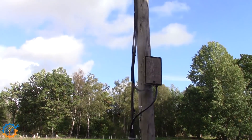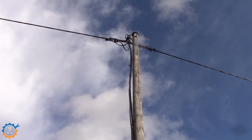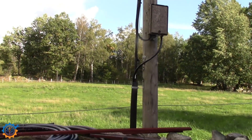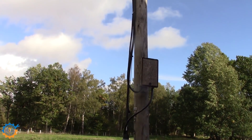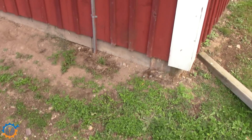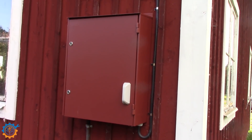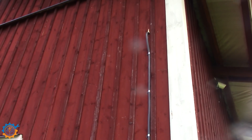Meanwhile let's take a look at the backside where I got the new power inserted. The line actually comes up from the earth going up to the top and then down again to my box. It is then transferred from that box down again in the soil, under this part, down through here and up to the house through this combiner box. The combiner box is the electric company's box and they take care of that part. It then goes into the house from that box through the wall.